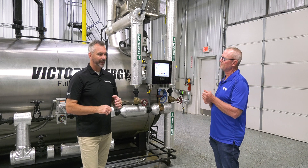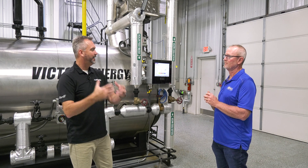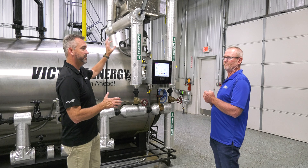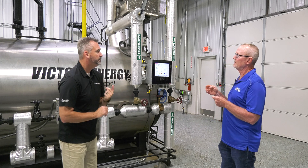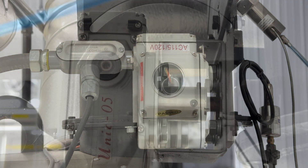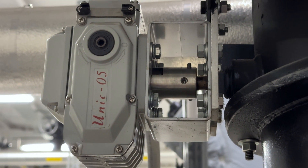When boilers are newly installed and they're trying to get the new burner started up, sometimes they need a little more back pressure and they'll do some things with the stack. There are a couple of things we can do. You can put a manual damper in, and for a lot of burner applications that works fine. Some of them it doesn't — if you're in a place where the wind changes direction, you have high wind velocities, or a high stack where on cool days the vacuum is at a certain point and heats up differently. So then we'll put a modulating damper in with a servo motor, and set the pressure on the stack at a point within the combustion curve so that we maintain that pressure throughout the firing range the same way.